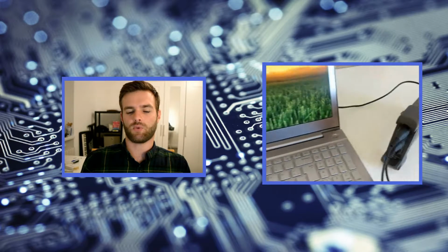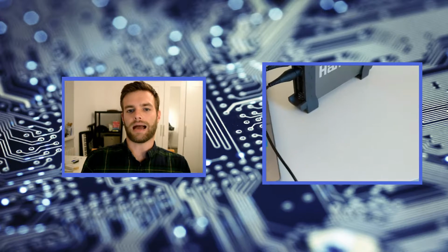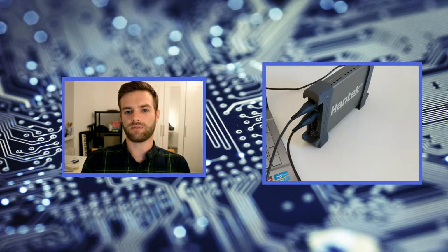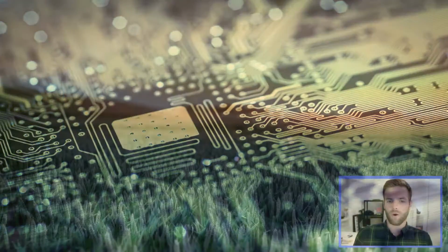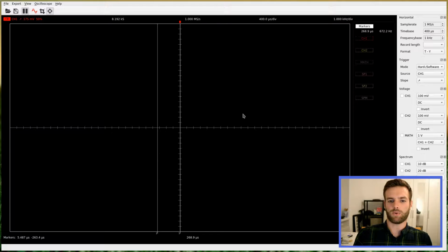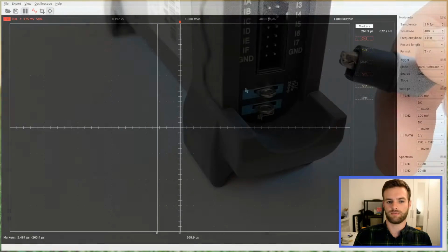The setup is quite simple. We just need to connect via USB to our computer and connect the two probes for measurements. I've labeled them so it's easier to know which one is connected to which channel. Once connected, we can now open OpenHantek to operate our oscilloscope. If properly connected, it will be automatically recognized by the software.